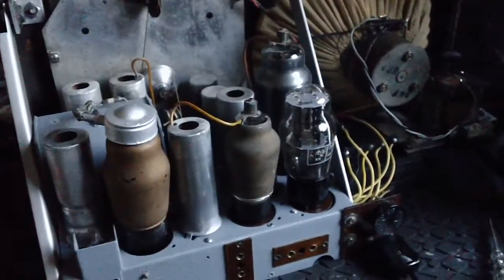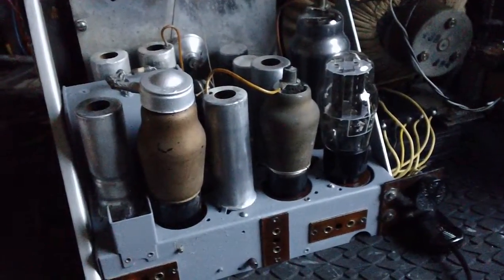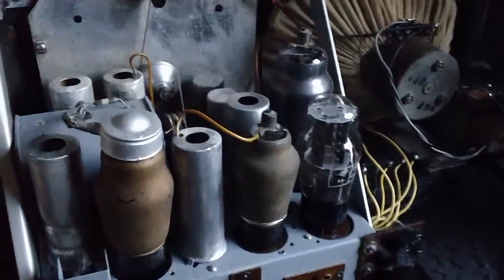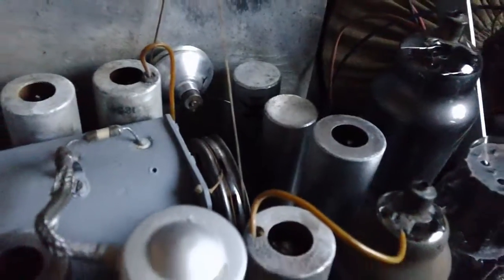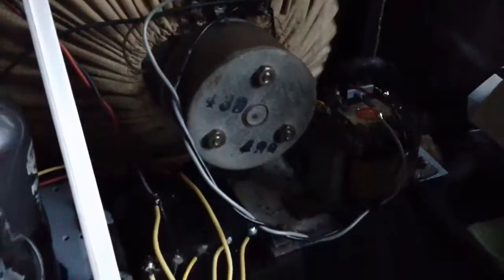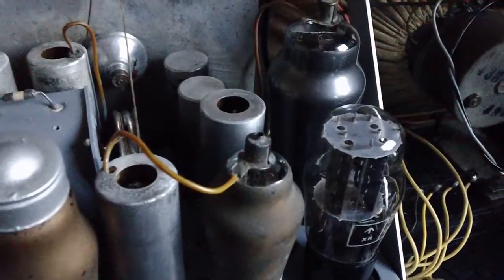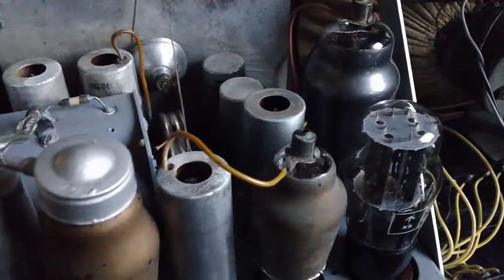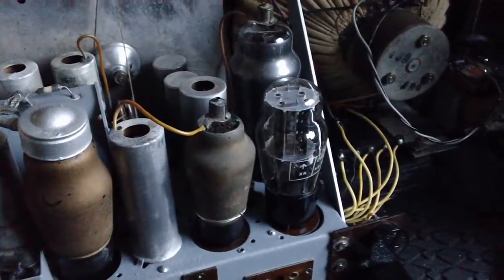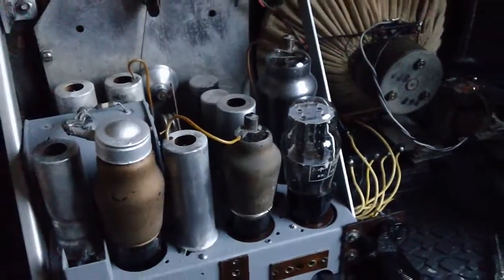I've got really very little confidence. I've done as much rewiring under the chassis as I thought was necessary to get it working. The capacitors have been re-stuffed and replaced. I've replaced all the wiring to the speaker and output transformer. I've not replaced any wax capacitors yet, because I just didn't want to put any more time and money into this.